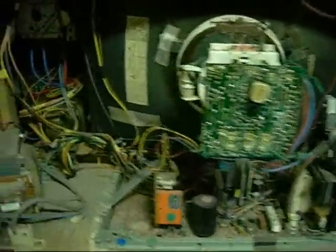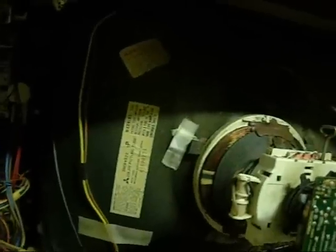Just needs a good rebuild — capacitors, that sort of thing — but it's too old to bother rebuilding now. Didn't go bang, doesn't smell like smoke. Let's whip the back off. Initially I thought this was actually a Sharp or Sanyo or something but it is an AWA — Mitsubishi Kowa tube, obviously a Kowa. There are a few ICs on the board but it's mostly transistors, so it's pretty old. No UHF tuning, just a standard VHF.